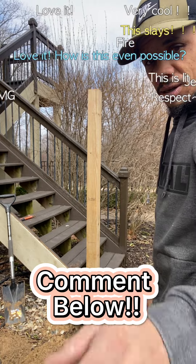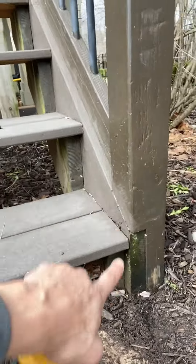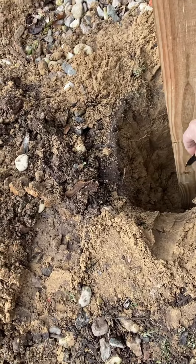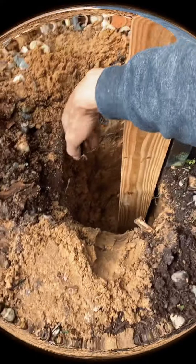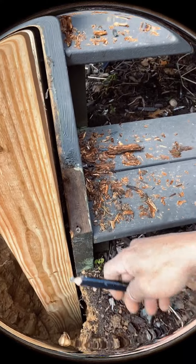Let's find that tape. Notice how it's notched — I'm flushed here, I gotta do the same thing on this side. What's different with mine is I've got it going all the way into the ground 20 inches so I can concrete around it and keep it sturdy. I'm going to lag bolt it, putting bolts through to strengthen it up. But right now I gotta cut my notch off.